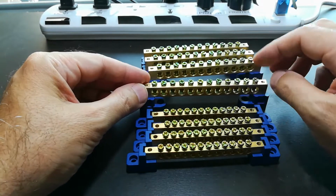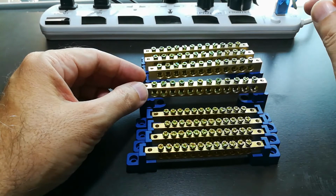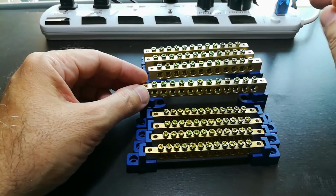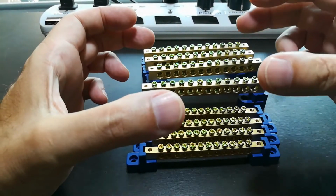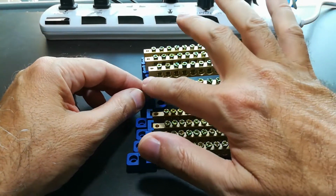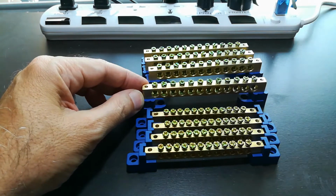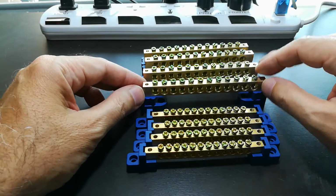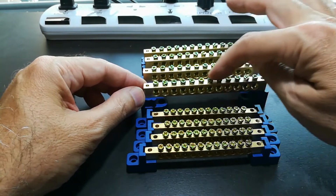Now, the battery pack I'm envisioning has 16 battery modules inside, and each one is going to have 20 batteries. So each module is kind of a battery pack on its own. And then they'll all be wired up in parallel. So I need 16 connections here, plus an out to the motor controller and the charger. So I'm going to have to even double up on some of these connections, but it shouldn't be too bad.